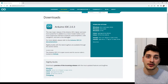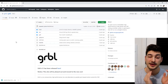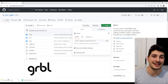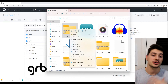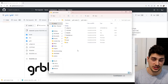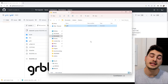First you need to have the Arduino IDE downloaded and installed — it's completely free and open source, and I'll leave a link in the description below. You're also going to need to download GRBL — spelled G-R-B-L all caps but typically pronounced 'gerbil' — as a library for the Arduino. When you download the GRBL zip file, extract it, go into it, and copy the entire folder labeled 'grbl' into your Arduino libraries folder, which is typically found inside Documents > Arduino > libraries.